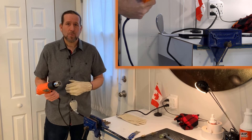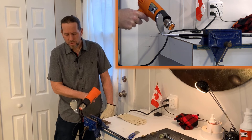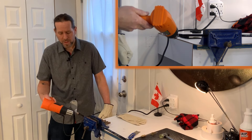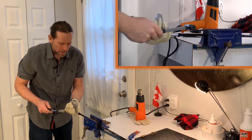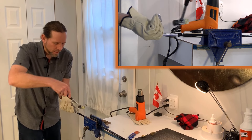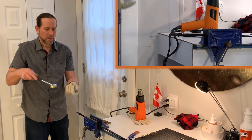I'm going to fire this up and see if we can get it hot enough. In the same routine, I'm just going to heat this all the way around. It might take a little longer than the torch, so I'll likely advance the video until it's ready to come off — it's going to take a few minutes. I've been heating that up for about eight minutes or so, and it's starting to pull off on its own, but I can help it with a little rubber hammer just to bring it straight off. I don't want to turn it, and once it starts coming off, just pull it straight off — don't bend and don't twist.